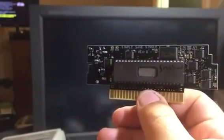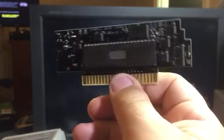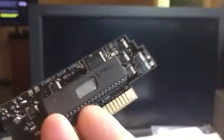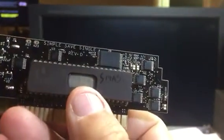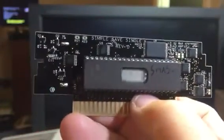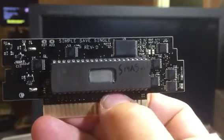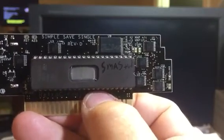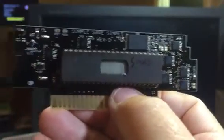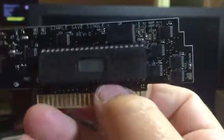So this is the next repo board to come from RetroCircuits, soon to be on mordoffgames.com. Because of its form factor, it'll be much smaller, should be less expensive than the ones we currently sell. But it's full featured. I mean, 256K SRAM down to 16K SRAM. So you can run just about any game. You can disable SRAM, high-low map. You can use 27C322s or 160s. Does not matter.